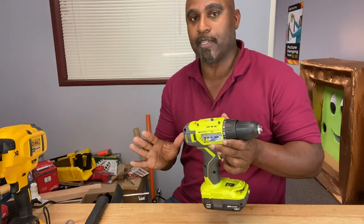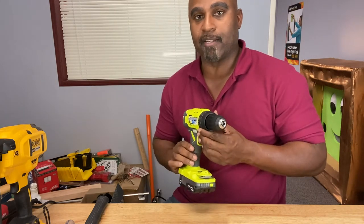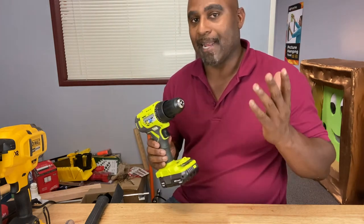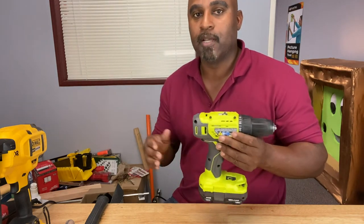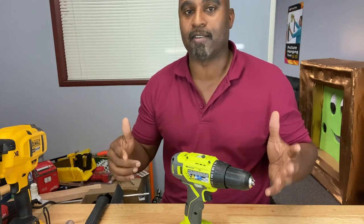The last thing to cover is vibration. Vibration is something you can't control because it happens at the design or manufacturing stage. The only thing you can do when using a vibrating tool is to try to insulate yourself from it — they have anti-vibration gloves and tool covers. Regular maintenance may also reduce some vibration. Research prospective tools before purchasing to see if they have a reputation for vibrating. If you're going to use a tool repetitively over a long period of time, use a power tool over a manual hand tool — this will greatly reduce the risk of injury, tendonitis, carpal tunnel syndrome, or conditions caused by repetitive use of manual tools.